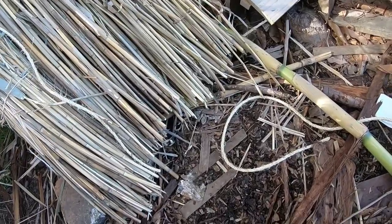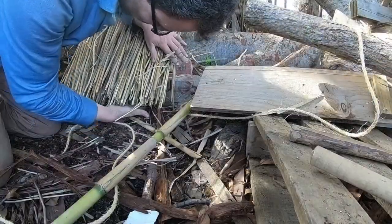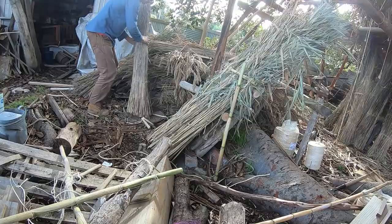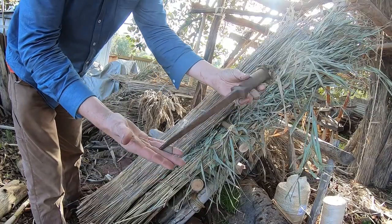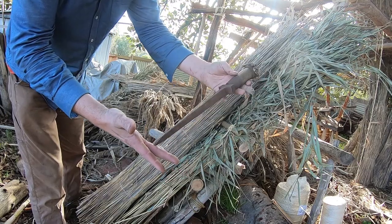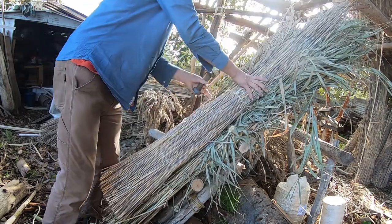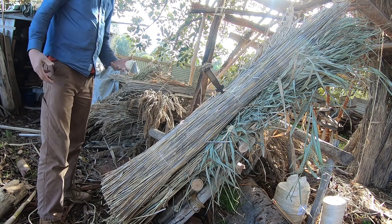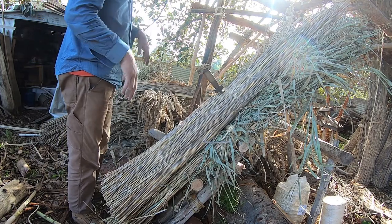What I'm trying to get to happen here is to have this layer — the bolt on the top and bottom of this layer being flat or horizontal, level with the ground, or even actually sloping back up on the inside — so that when water comes down on the outside it'll basically form a drip layer just there. Now I've got these Japanese boat-building chisels, which I'll be doing a video on in due course, and I'm using them to hold these in place — that works rather well. I used pieces of bamboo to do this last time, but they worked okay but not great.